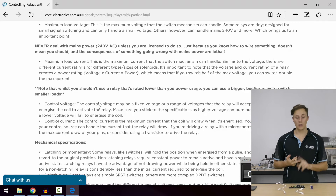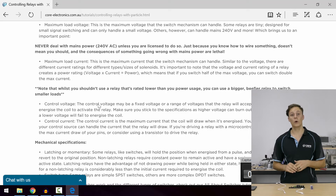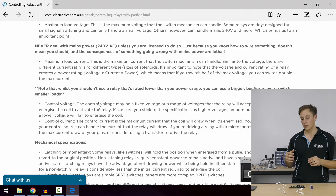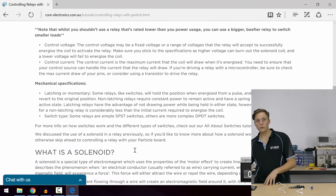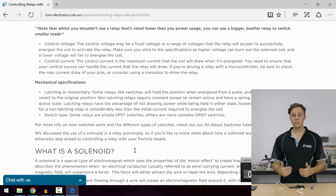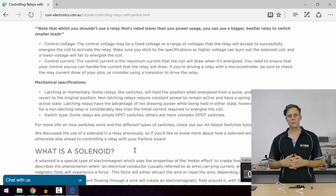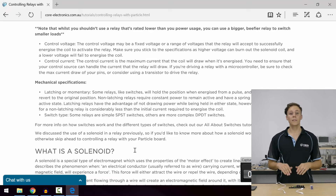The rating of a relay is purely based on the size and integrity of the mechanical connections. There are a couple of important specs to keep in mind: you have the rated voltage and current on the switching side - the load you're switching. It's important to note those specifications are a function of power, so even though it's rated up to 220 volts, if you're only switching 10 volts it's going to be able to carry more than 10 amps because power equals voltage multiplied by current. You also have the control voltage and current - the voltage required to energize the coil. Too high and you risk burning out the coil; too low and you may fail to energize it.